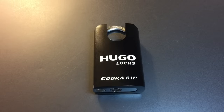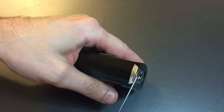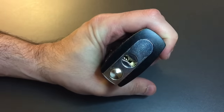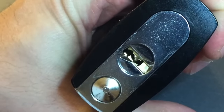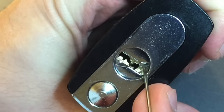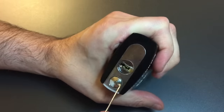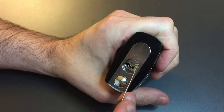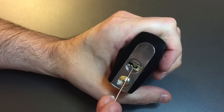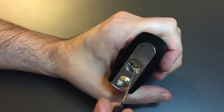Now that the lock is back together, let's get to picking. Let's talk about the challenges it presents. First, it's a really heavy lock, so it's going to be difficult to hold. We have a thick retainer plate and a spinner that the core sits behind, so we're picking at a core that's well set into the lock. Then we have some really nasty warding, and we're going to have to use a curved pick to reach the higher set pins — I don't use a curved flag very often, but for locks like this it's absolutely necessary. Finally, picking direction is the largest challenge: we have to tension and pick in the clockwise direction. I would normally pick counter-clockwise, but unfortunately there's no way to fit a pick on the left side of the pins, so we'll be picking from the right side, also in the clockwise direction.